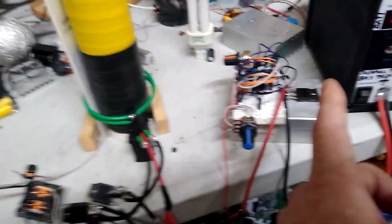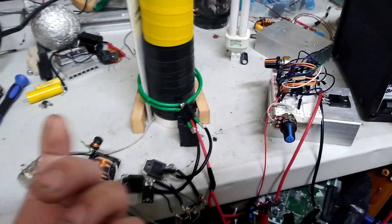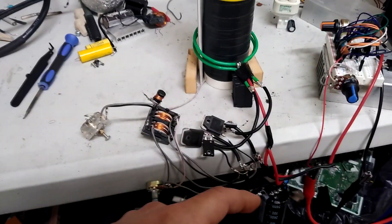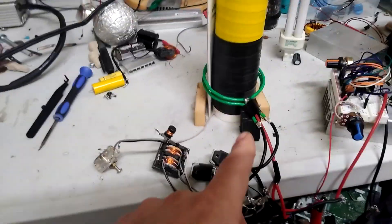What I had to do was put the PWM on the power rail, and that was pretty much how I could simulate what was going on. By pulling the gates to ground using an interrupter, it just wasn't working with this setup.